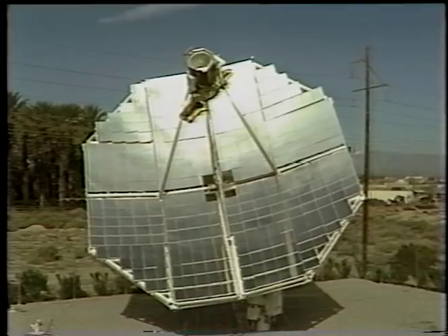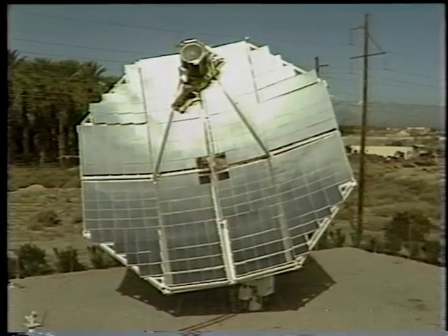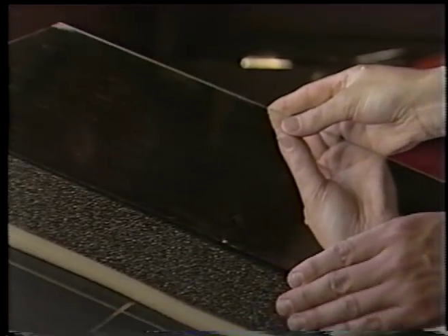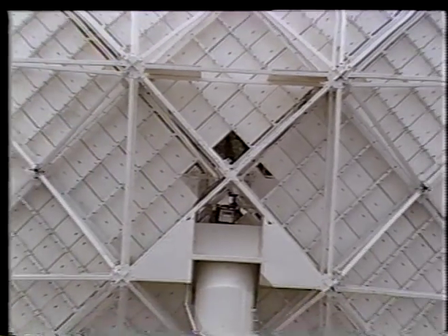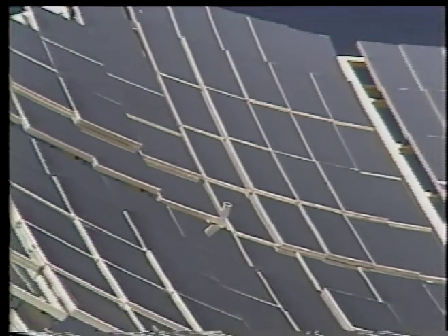Vanguard's magnifying glass is the parabolic dish concentrator. It has a diameter of 11 meters and consists of 336 mirror-like facets. These facets are made of highly reflective back-silvered glass attached to a foam glass substrate with a slight spherical curvature. The facets are mounted on 16 racks, ensuring a sturdy and accurate reflective surface under various wind and gravity loads.